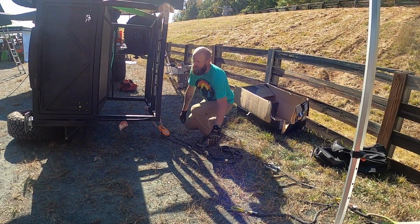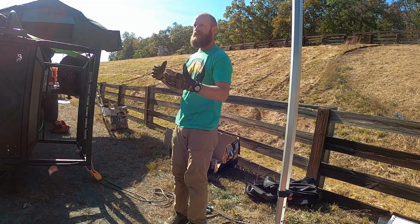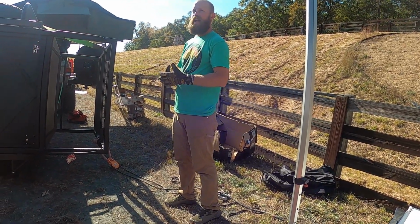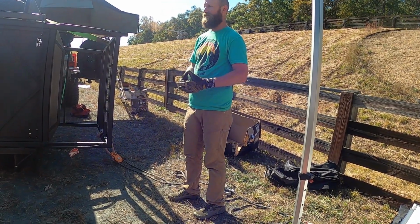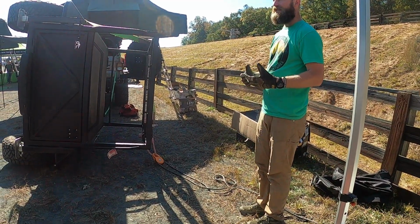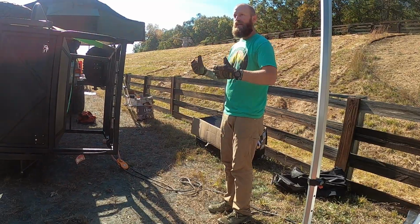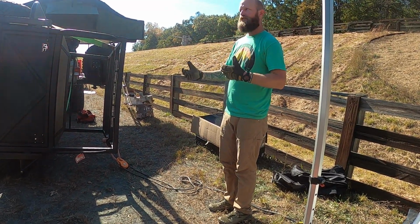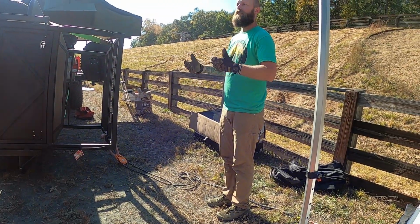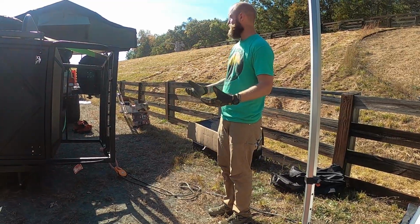The good thing is once I pick it up with the winch, I can hold it in place a little bit as I fix my rigging and move around it. This does not have to be a fast operation, right? Sarah, you want to hop into the truck for me? It does not have to be a fast operation, so I don't have to be here trying to rush through this as much as I can. We can lift it a little bit, check it, make sure all our rigging's good, check it again, lift it a little more, do it bit by bit, right? The most important thing is the safety aspect of it.